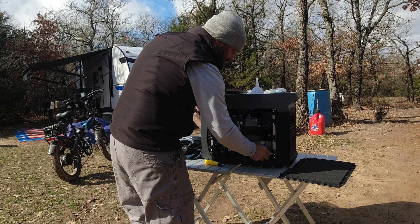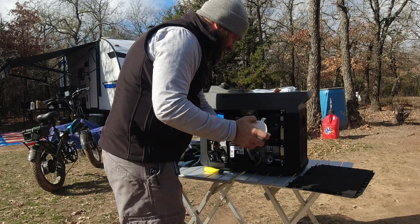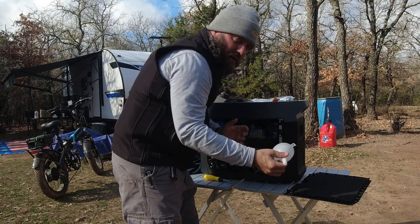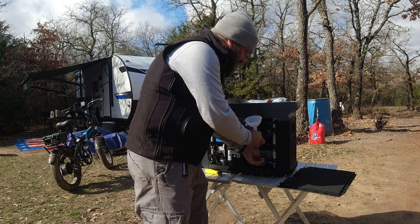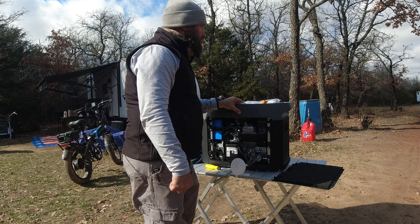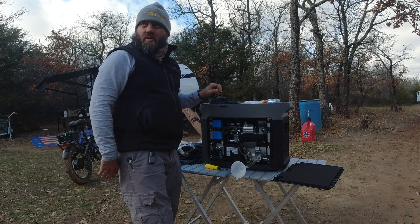It also warned about not putting too much oil in it — always a good plan. So I'm going to put some oil in. The instruction manual says don't tilt the thing on its side when filling oil. I always did that with my other generator, but you'd just tilt it back down and let it run out a little bit — not a big deal if you know what you're doing. They're just being cautious, which is a good thing. The manual says to put 10W40 in it, which is different from the SAE 30 weight I used to put in older generators. These new generators don't require such a heavy oil, and this one specifies 10W40, so that's what we're putting in.